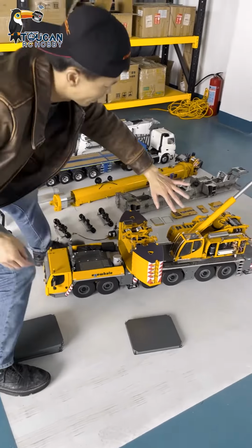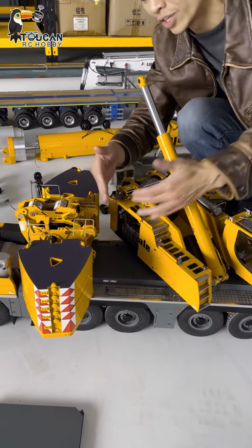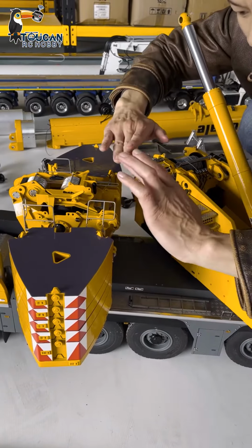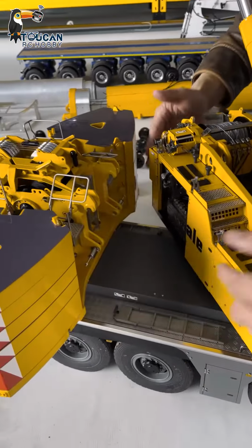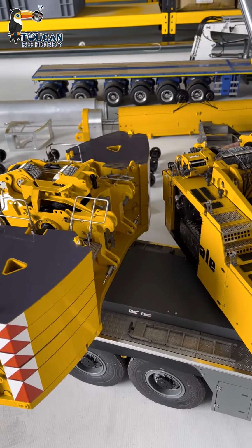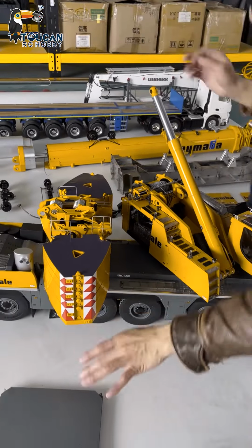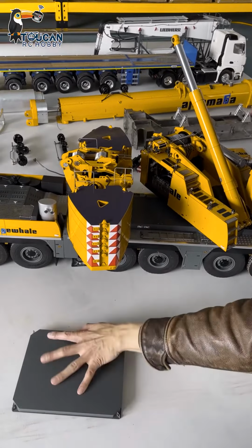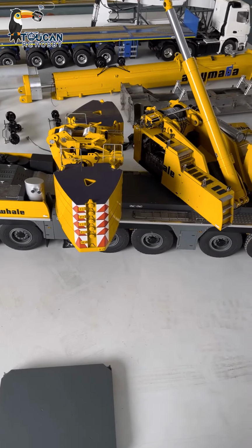So after the block is lifted and put in position, first lift up this connection bar by hydraulic lift. So this one can turn in position and then the pin will be at this hook, and then drop this arm to lock in the hook and then manually secure the downside pin. Then this weight block is secured to the rear side. Then you can rotate, take back the legs, do the second level expansion, and then stand the legs more outside for balancing, and you can start normal operation.